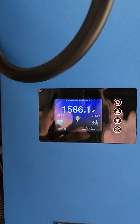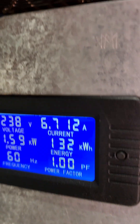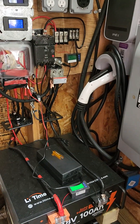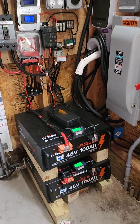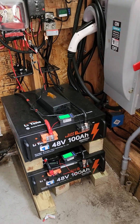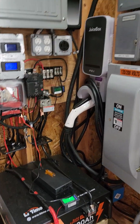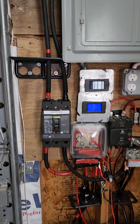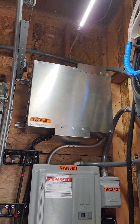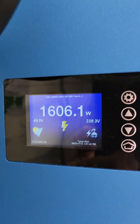So I've got not a great time to do this test, but I'm going to show you anyway. I'm getting a really nice output from the sun — generating almost 6.7 amps at 240 volts. What I found yesterday was I depleted these batteries because I was greedy and wanted to get as much energy as I could. And then a thunderstorm rolled in and I had no battery. So that's where you have to be cognizant — when these guys get charged up, shut them off and use the excess solar to go back to your grid. If the power had failed yesterday and I turned on this breaker for my 10 kilowatt inverter, there would have been no juice left. This thing is really kicking, it's nice.